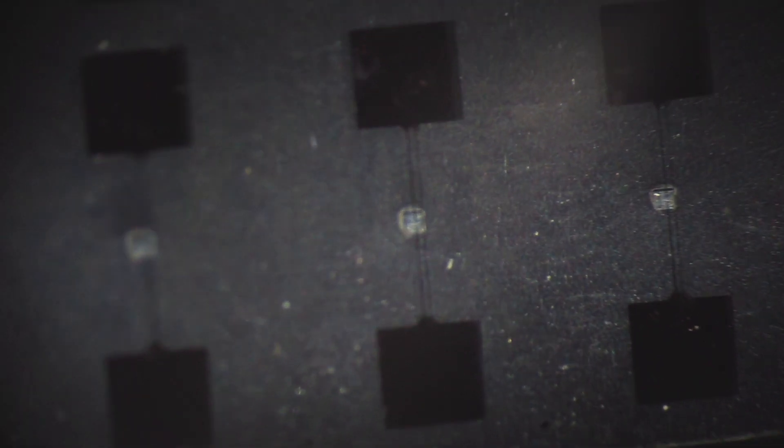I should note there are some big downsides to using shadow masks or micro stencils. The resolution you get out of a stencil is just a lot less than any type of photolithography method, especially modern versions. That's really why the industry has mostly stopped using them — the resolution is pretty limited by the material you're etching or, in our case, ablating through. The metal stencil can only support features so small before the substrate starts to fall apart, or it's so thin that the features start getting wavy. One advantage of a shadow mask is reusability, but that also represents a disadvantage over time: because metal is being deposited on the mask itself, the features you've etched will start to close in over time and might completely close over.